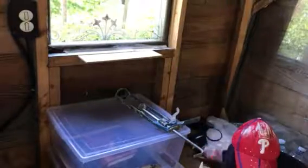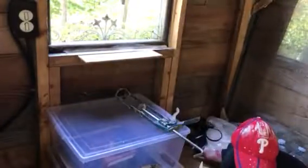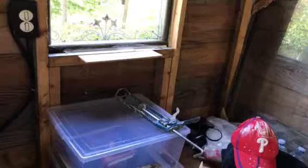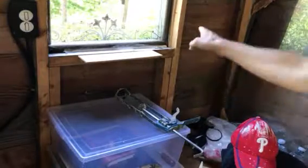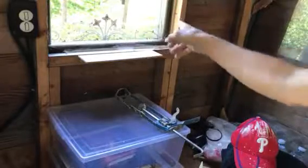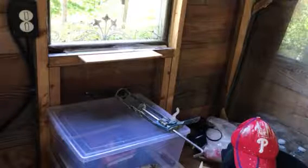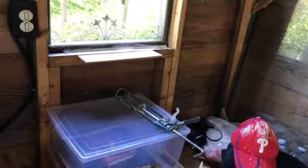What we do is we take our rag and we wet the rag. We put our finger behind the rag and we smush and move the rag a little bit and do it again. Move the rag again. That way also, when you leave a water-based caulk wet, in fact, sometimes I'll flick water on the caulk and then come over with my fingertip, and it leaves a nice smooth finish that you let dry completely, and then you paint.